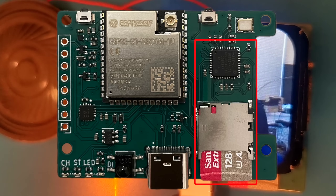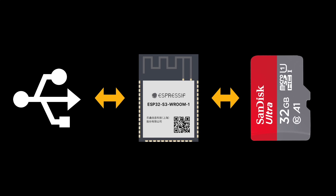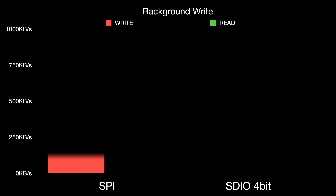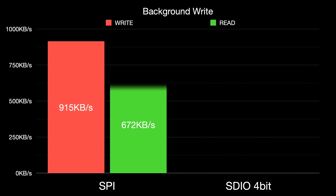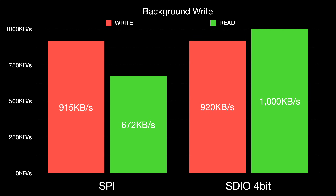This is the most exciting thing on the board. If it works, we can load files onto our TV without needing to unplug the SD card. It is already possible to access the SD card directly from our PC using the ESP32 in mass storage mode, but it's painfully slow. I did manage to get it up to 1MB/s reading and writing, but it took a lot of hacking, and it's still not fast enough, especially if you want to transfer large video files.